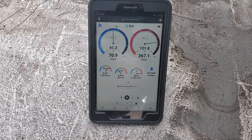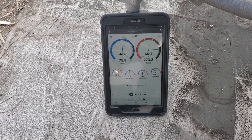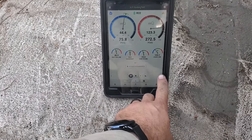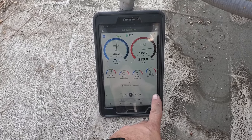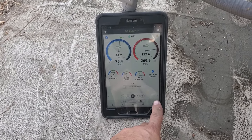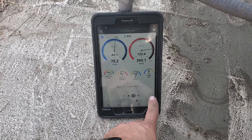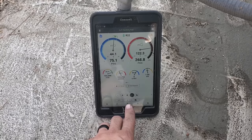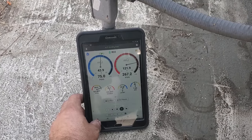We're going to jump onto the second stage now and see how that's doing. The second stage is kind of looking about the same. The TD is going to be high, but that's because of pulling outside air. Temperature split's high — I'm not a fan of that. But it's not going to be perfect. I think that's good enough for here.